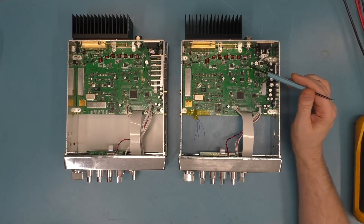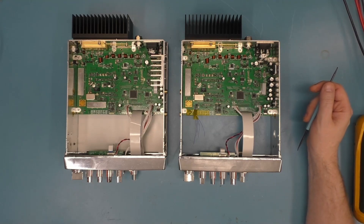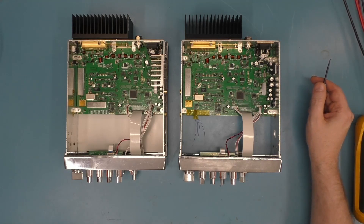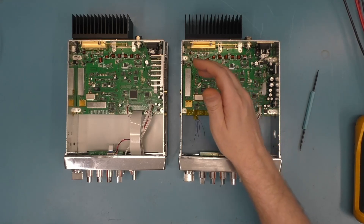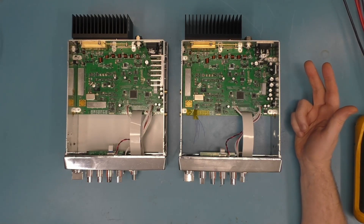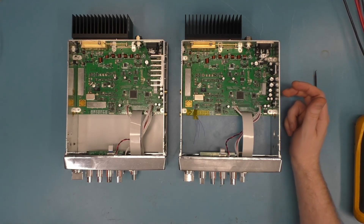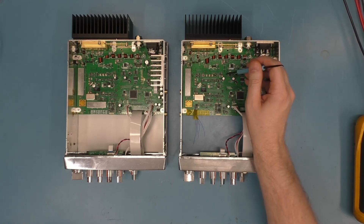Typical receiver: capacitively coupled stages — no more transformers, no more things to tune or tweak. It is all controlled by digital-to-analog converters. This DAC controls bandpass filters for the receiver, RF power, and bias. Your RF power, bias, and receiver self-alignment are all done in software and commanded by the microcontroller. The only thing implemented in hardware is the AGC — that is the only thing done in hardware; everything else is controlled in software.